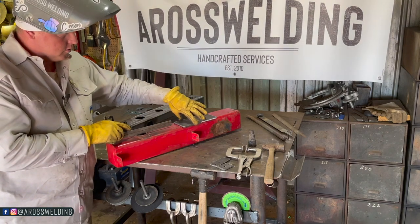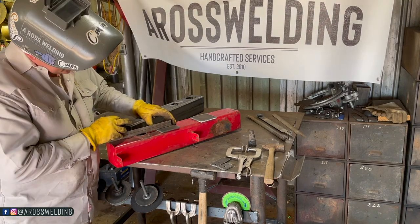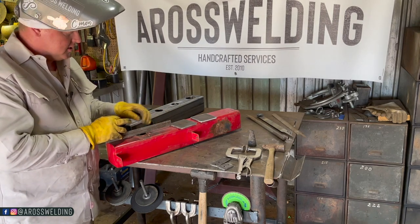I know this is a 1/4 inch plate and it slides underneath there. You wanna make sure this straight edge is touching on both sides. And it slides underneath there with a little bit of gap. So I'm gonna say we got roughly 5/16 of a gap.